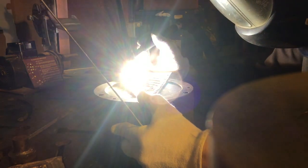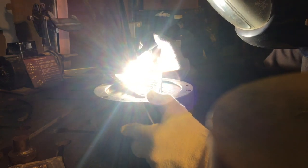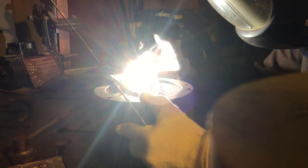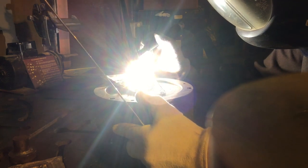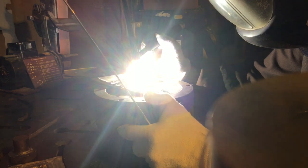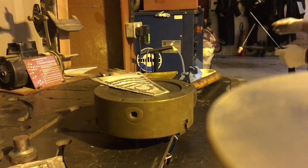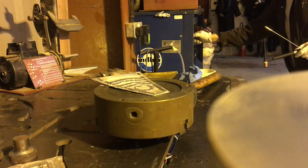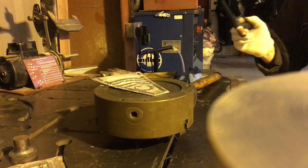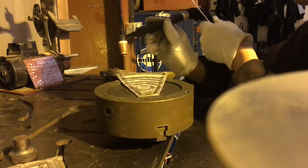Before I do anything, I'm just letting the cleaning action put me a guideline on this aluminium. That'll mean that when I weld, I can turn up the penetration a bit — I won't need so much cleaning action. It's a fairly clean plate anyway, but it also lets me weld with a 1/16th tungsten without ruining it, without melting it. I've only got 100 odd amps here, so not a problem.